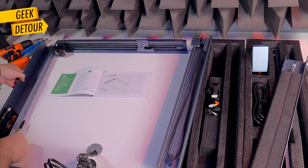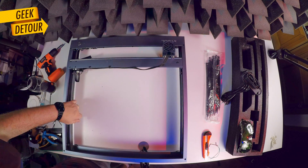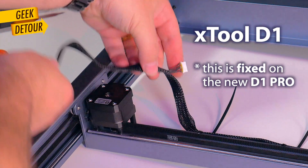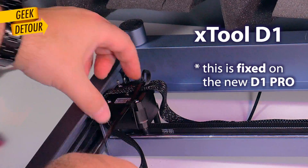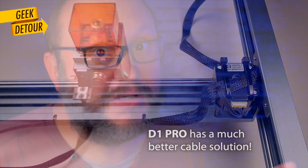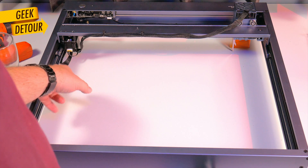Assembling is very straightforward. The manual is excellent — it should take roughly 30 minutes to follow the steps. It's a very clean design, all flush. The frame gets very rigid and naturally squared. There is one step that, if you just follow the manual, you might have a problem: this delicate connection gets stressed as the cable moves and eventually breaks, unless you find a way to secure the whole cable to the motor. I used larger zip ties — I really recommend you do the same, because if the cable dangles hanging from the connector, it breaks. Even sturdier is a drag chain, like the excellent work from Vidar — I'll put a link in the description. Don't forget to tension the belts.